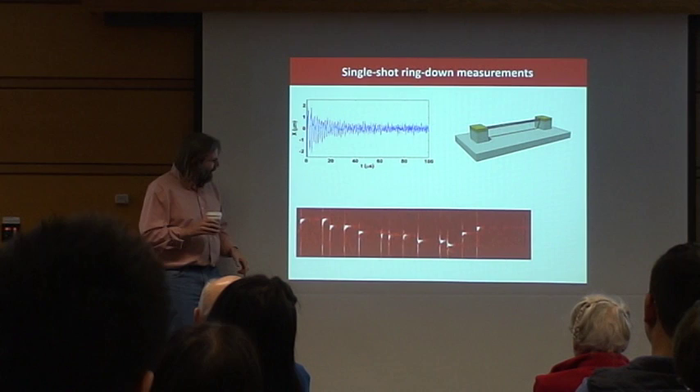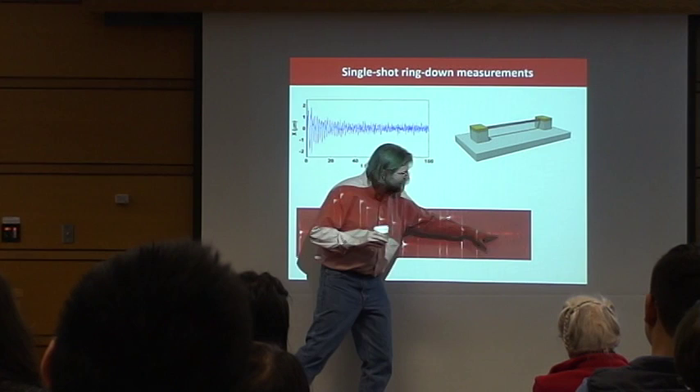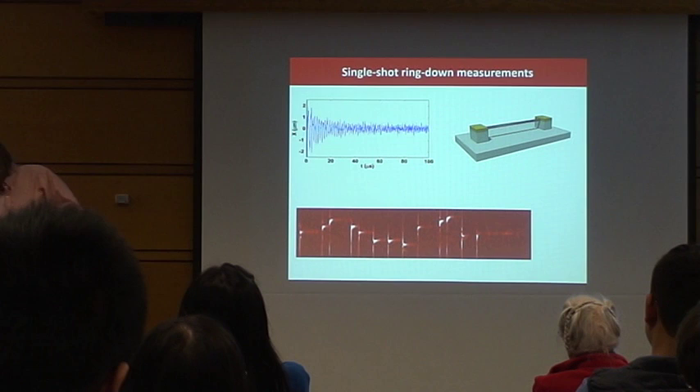There's all kinds of physics in here — you'll notice the frequency shifts a little bit. This is the nonlinear jerking in the system as you drive it hard — it shifts the frequency. And you can notice it's even vibrating out here when you're not plucking it. That's the thermal vibrations of the nanotube directly in this.